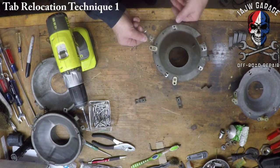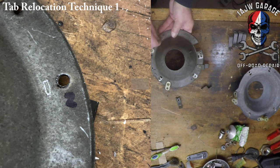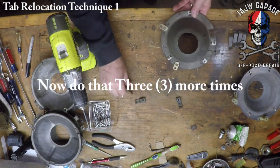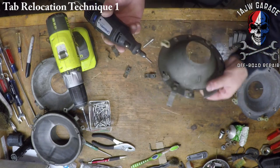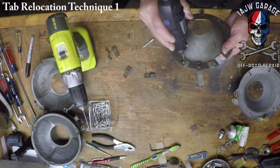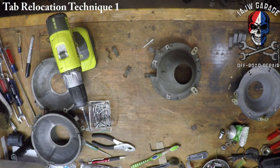What I did was use the back side corner to mark where the end of the slot is, just using the rivet to draw a slot — pretty simple as it gets. What I figured out was this bit from my Dremel is just small enough so I can drill a hole and then grind it over — drill two holes, one on each end, and then connect it in the middle. That is the next step.